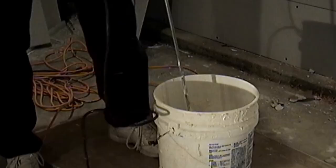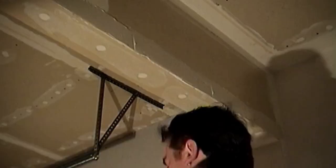You don't want the 6-inch knife not to be touching the very corner of the tape-on corner bead, because the tape-on corner bead is rolling up on one side or the other. This would make that section of tape-on corner bead very vulnerable to chipping, due to the buildup of drywall compound to make that corner.